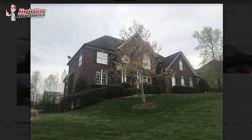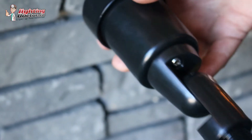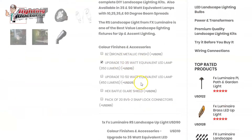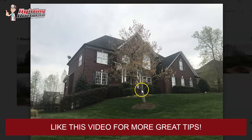For any trees under 20 feet high, you can get away with a standard accent light — a 20-watt equivalent lamp, which is about a 4-watt LED. For other areas you'll want a slightly brighter 35-watt equivalent to get light to those top peaks. On a tree like this, I'd place one accent light at the base shining pretty straight up, catching the trunk, branching structure, and some foliage.